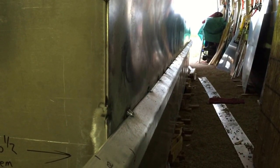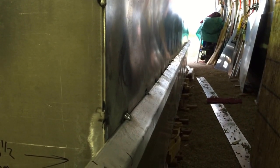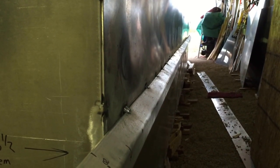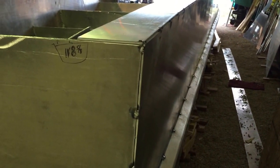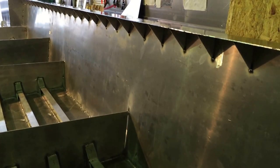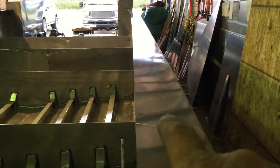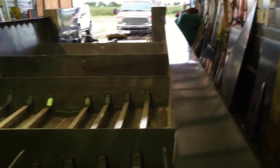The side walls were also trying to get wavy down the sides of the boat. I needed to put a rub rail on there — I wanted two, but I had so much wave going on and had caught it a little too late, so I ended up putting one on basically right in the middle. I'm pretty happy how it worked out, honestly. I should have put that rub rail on as soon as I had the sidewalls on, before doing any interior work.